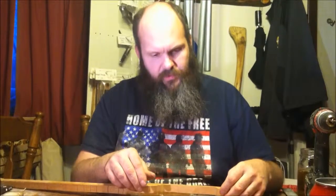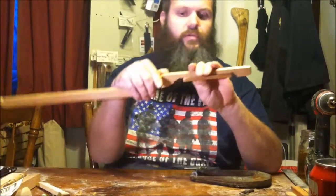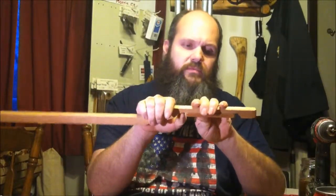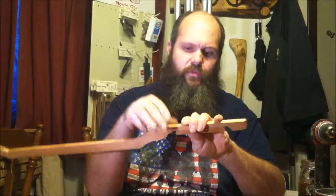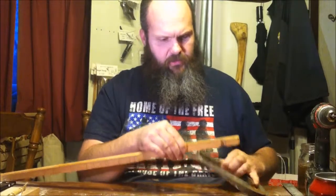We've got a couple more holes we need to drill, and we really ought to do that before we put finish on it. The piece we had — remember we shortened it — you can see about how much I shortened it. That makes it so that it's not out on the edges on the rims of the can, because the rims are formed and they really want to turn the corner, so you'd just be fighting against yourself — it makes the can pucker and it's just bad.